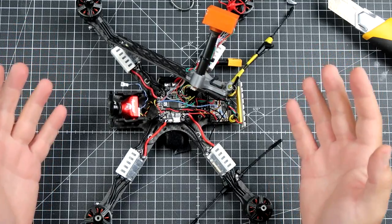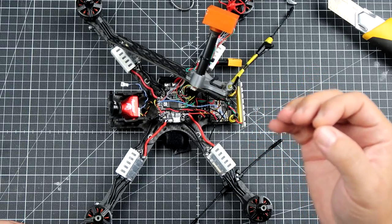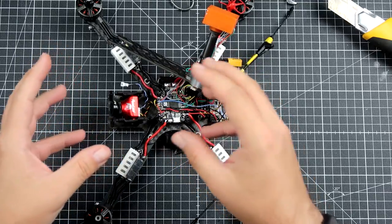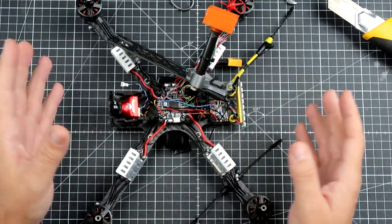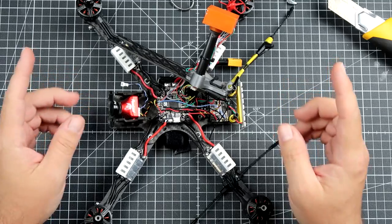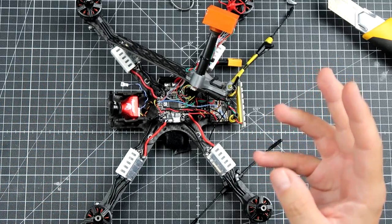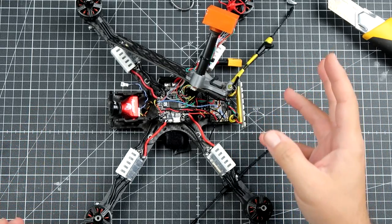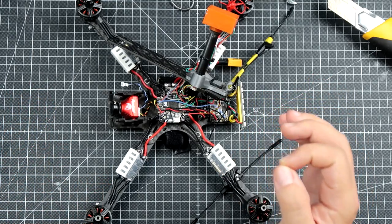Of course, for a clean video signal, you have to have clean voltage applied to both the camera and the flight controller for the OSD and the VTX. So of course the capacitors attached somewhere on the battery line usually are required, but this does not always work. From time to time, even if you have a good, low ESR capacitor on the main battery wires, you still get noise on the video line.